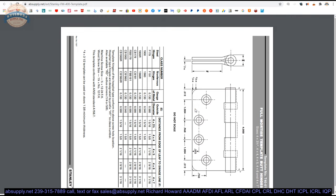You can do four-inch tall hinges on hollow metal. You'll see those types of applications — inch-and-three-eighths doors in hollow metal frames in condo buildings along Lake Michigan in Chicago, from Ohio all the way up to Loyola University, those 30- to 40-story buildings. They're full of hollow metal frames, inch-and-three-eighths doors, hollow core wood doors — original construction from the late sixties and early seventies. You've got hinges like this in those frames, template pattern.